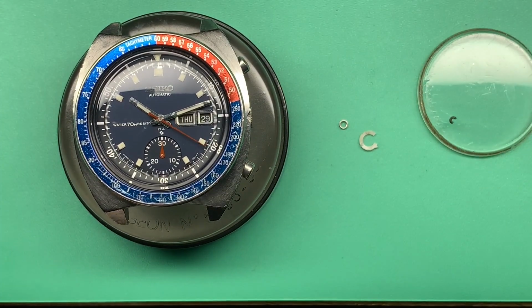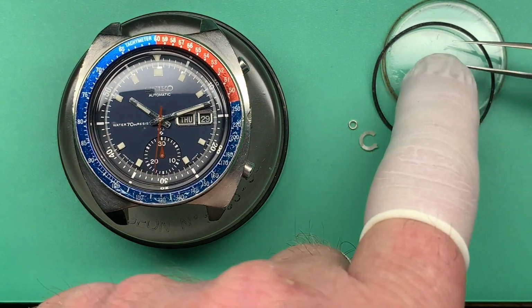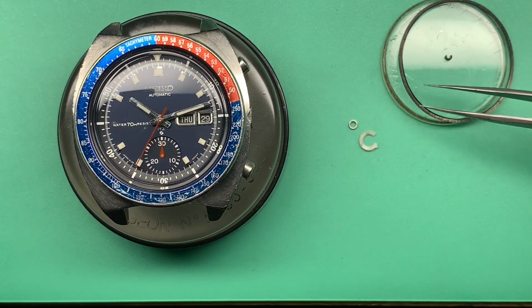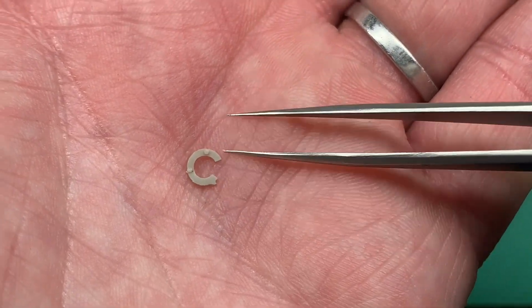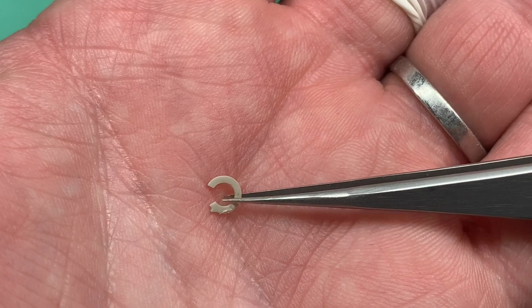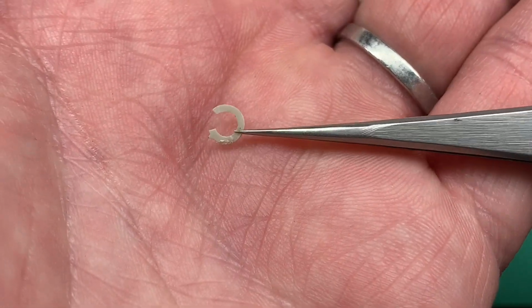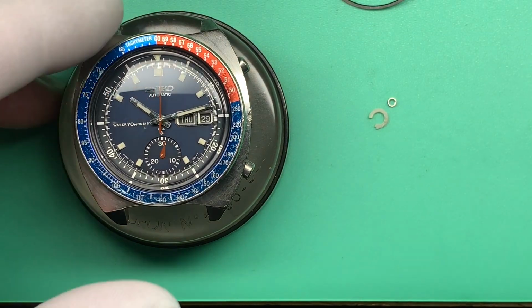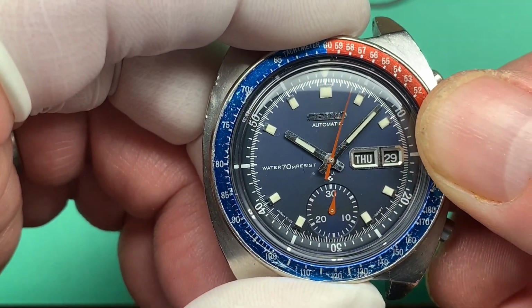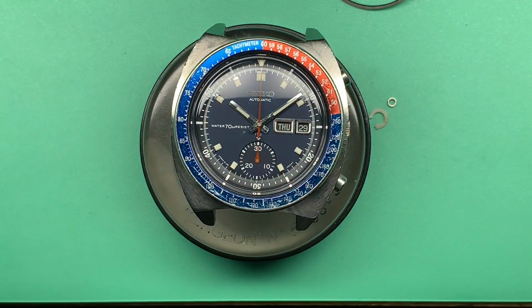And so these are the parts and pieces from your 6009 movement. So this is from your case, of course, as is this. So these are case parts. This is your original crystal and your original seal. And in your movement, we had to replace this. This is the finger to advance the day disc and it was really not in good shape, and in fact it was tweaked so badly it wasn't allowing things to turn properly. You can see here it's got some issues, but that was replaced. A very simple part that I have a lot of. There's your bushing for your upper mainspring arbor port. We jeweled the arbor ports in this, and it just made a huge benefit. It was so great. So you have a really nice 6009 that's ready to come home.